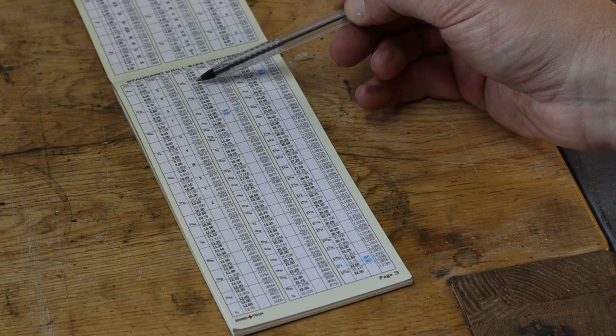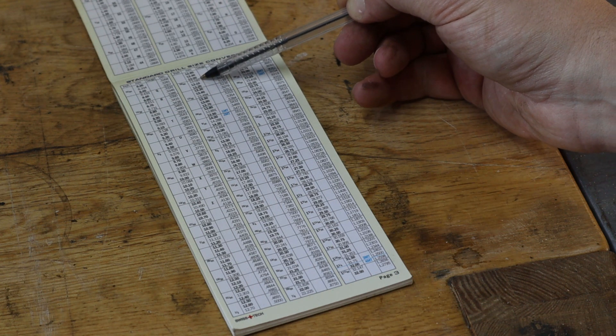If you look up the thread tapping diameter drill bit size for a 9/16th UNF bolt in your handy trusty REF book or Zeus book, you will notice that you need a 13.097mm drill bit. In my book, that rounds to 13.1, and when tapping things like this, 13mm seems close enough to me — so that's what I did.